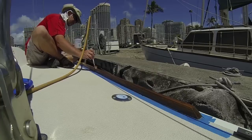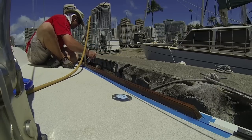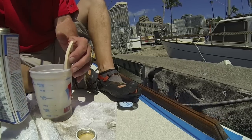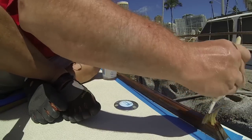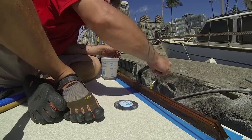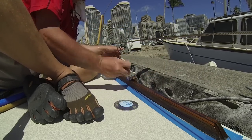Once you've got that coat dry — which should take about an hour or two in direct sunlight — go ahead and apply your next coat. You don't need any prep in between coats. It should take about five or six coats to get to the finish you want, and it could take up to three or even four days to get those coats built up and dry in between.